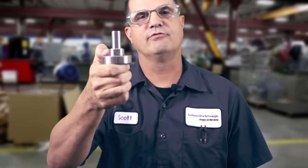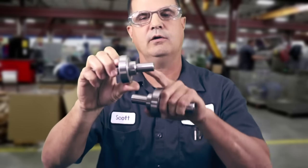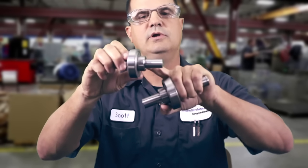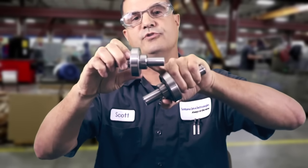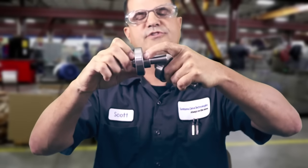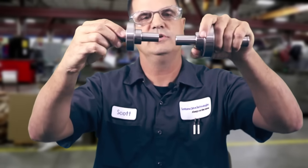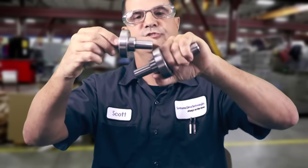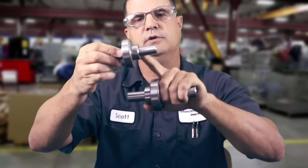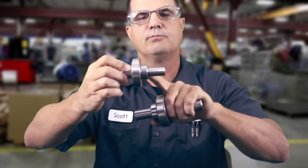One of the first things we learned from angular or parallel misalignment is a wear pattern on the collar itself. These collars are plunge ground, and if the seal has more pressure on it than designed for, you'll see a groove that's more predominant on one part of the radius than another. In other words, the shaft is kicked one way and the seal wears much faster — you'll see that leak much quicker than the typical recommended 12 to 18 months of seal life in a standard application.